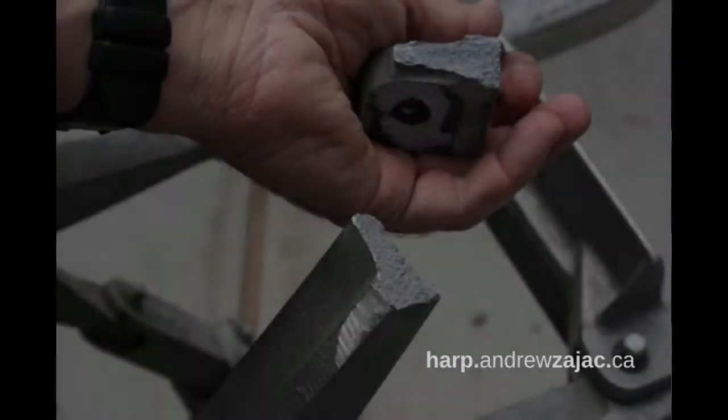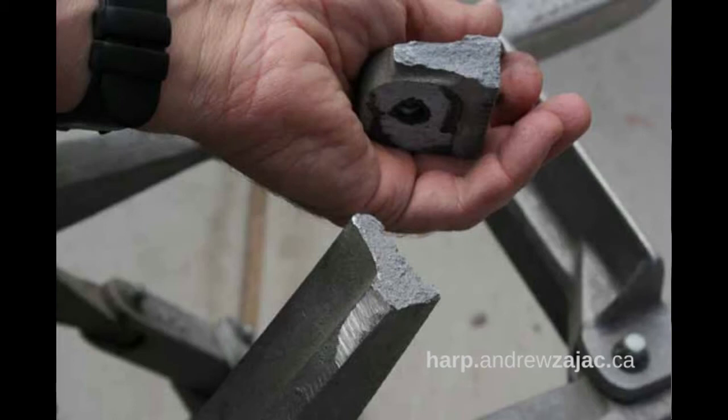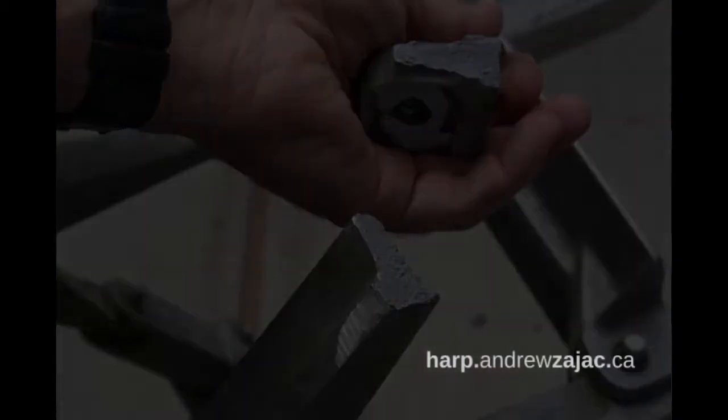The problem with that point is that maximal hardness is too hard — it's too brittle. So what you need to do is the third step, which is you temper it. You heat it back up, this time around 300 degrees, and you temper it so it becomes tough — at the same time hard and flexible, so it won't shatter and it'll last forever.